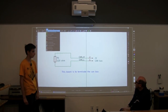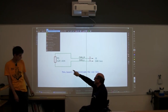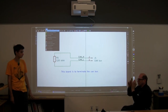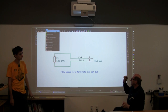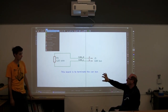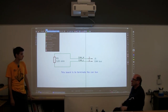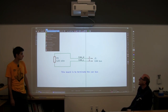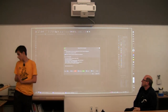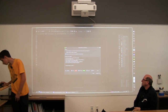One note is the schematic describes the interconnect. We've got these wires that we drew in, and the schematic captures that netlist of what is tying from what pin on what device to what pin on another device. Then that, along with the footprints that we identified, gets passed through to the PCB layout tool, which is the next step. That's okay, we'll fix that later.